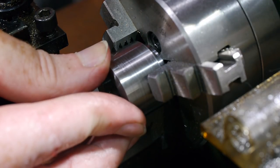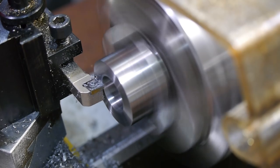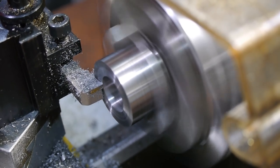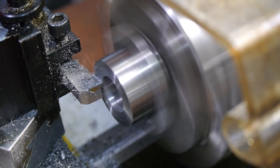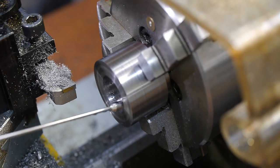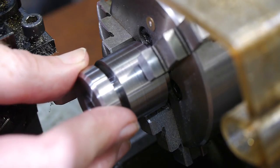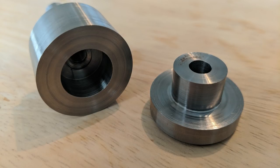The body of the tool was much easier to rechuck, and the surface to relieve was much more accessible. I cut the relief to the same depth of 0.2mm on this side. The two parts still fit fine, but there's no obvious difference. The end result is a sleeker, better looking tool that should be easier to use and cut better.